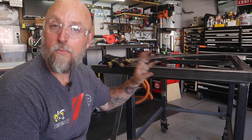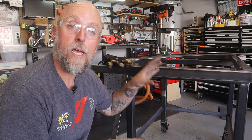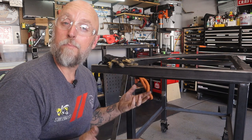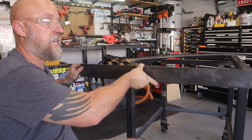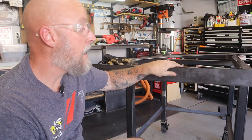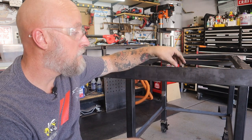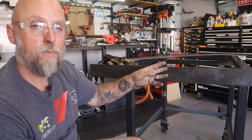Now, for the gantry rails, I know you can buy linear rails, both flat and round ones, and they're really nice and smooth. The bearings that ride on them are good quality stuff, but they can get pricey. And with me trying to keep this budget-minded, I think what I'm going to go with is some 1/8 inch by 3 inch wide plate. I'm going to mount this, not with magnets, to the side rails and leave the top and bottom, which should give me about 1/2 inch exposure, both top and bottom. That way, if I ever need to replace this, I can flip it. If it gets a bunch of slag along the edge and really messes up the ride of the gantry, I can flip it over, or I can just easily replace it.